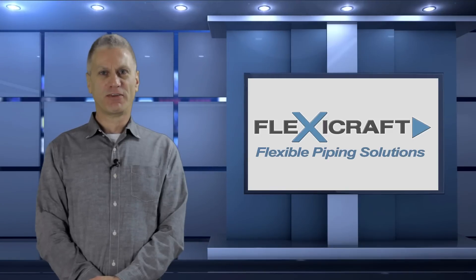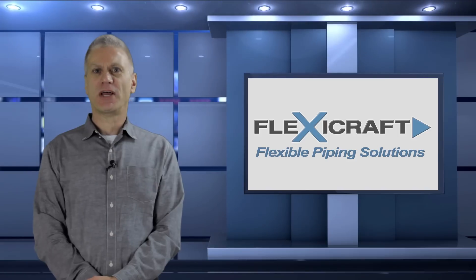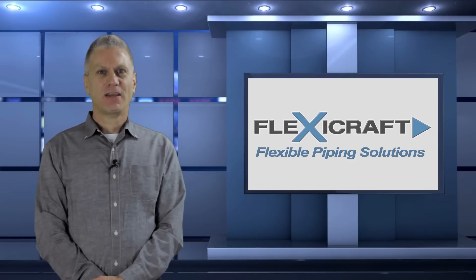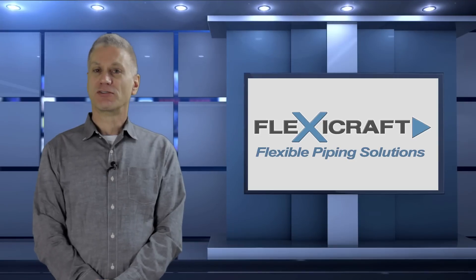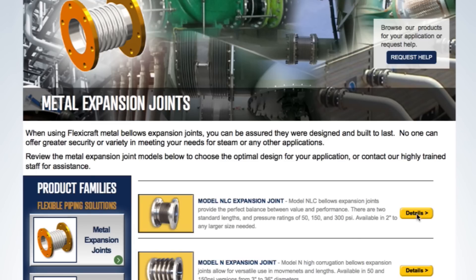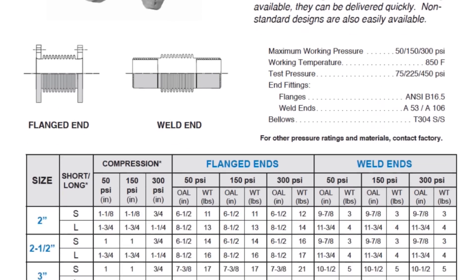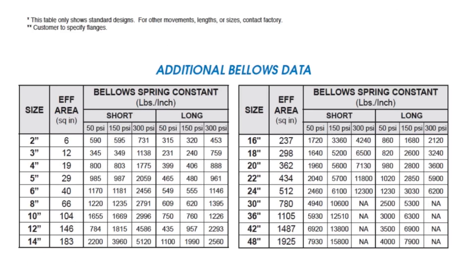The anchors must be designed for the force of the thrust load, which is equal to the effective cross-sectional area of the bellows multiplied by the pressure. In addition to the thrust load, a second load — the spring load — is added to the anchors when the joint moves, which is equal to the joint spring rate times the movement. The spring load is usually considerably smaller than the thrust load and does not normally cause the same confusion. The effective area and spring rate parameters are listed in our tables and submittal sheets for our various models, and are normally required input parameters for computer piping models, but the loads can also be simply calculated by hand.